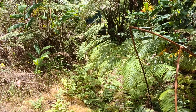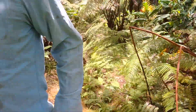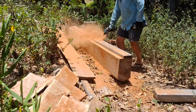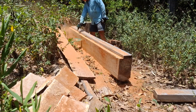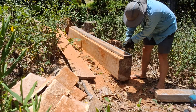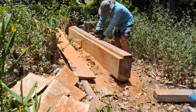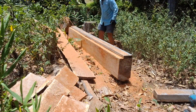I like using a wheelbarrow to carry everything — the saw, the jigs, the batteries, and other tools — across difficult terrain to the log. Here is the 12-foot log I've been working on. It's a species from Australia, Eucalyptus robusta, aka swamp mahogany. The mature red heartwood is very hard and dulls chainsaws quickly. For North American comparison, it's similar in hardness to white oak, and it gets even harder as it ages. This log began at around two-foot diameter, but was allowed to age for six years until the bark and some of the sapwood fell away, leaving 22 inches of hard, rot-resistant heartwood.